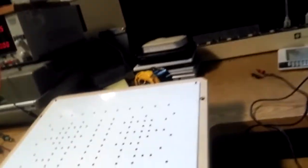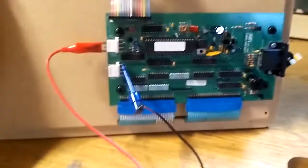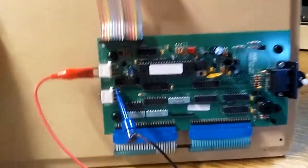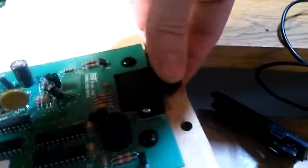So I took apart one of these display thingies. The reason why I bought it was because I saw a board inside, but I don't see what this was for. Anyway, the display would have been covered up somewhat. There's a little LCD display there, and I managed to get it to power on by hooking those two pins up to positive and that one pin to ground. There's a strange key-like thing here.